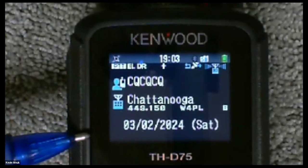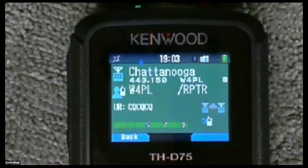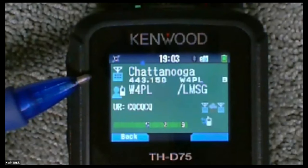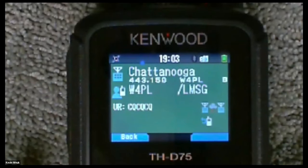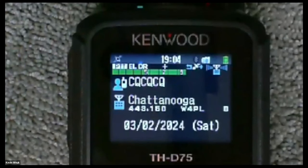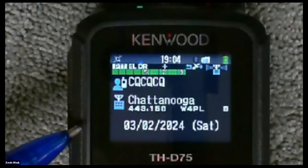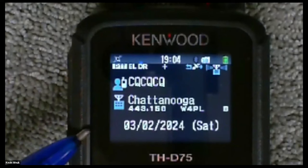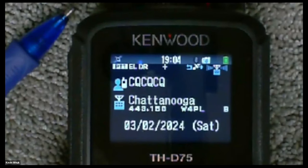Your weather stations are down there, and other functions. And then your A band, did I say that correctly? That's B band I meant. The A band will be the one that has your terminal mode. It has to be up in that band. Sometimes you'll get different things using the same resource. So if you're doing APRS on your B band and you put weather alert on, just realize it won't beacon. This radio does so much that you wind up using multiple things using the same resource. But the A/B button basically just swaps you back and forth.